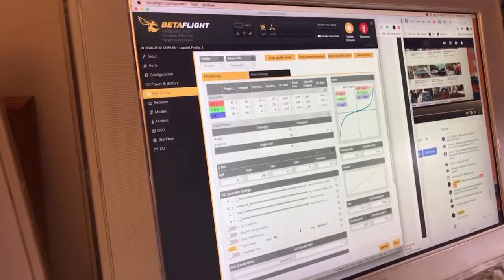If you have it set to be really sensitive and really start to ramp the D gain up under very small movements, it could put the D gain up to the maximum, 30, 35, and 38 here, when you don't want it to. So it's a little bit of a balance there, but the defaults are really, really good. They did a real good job on the defaults. So just tweak those a little bit.